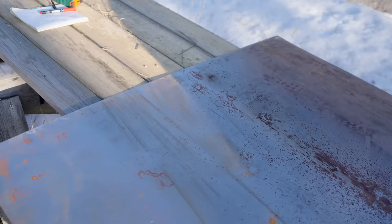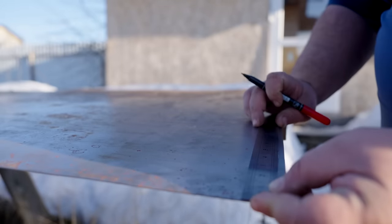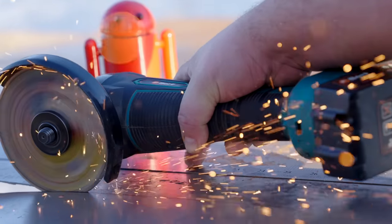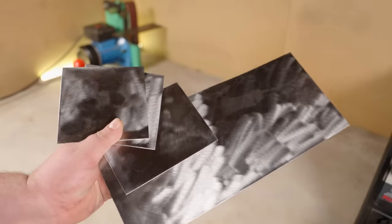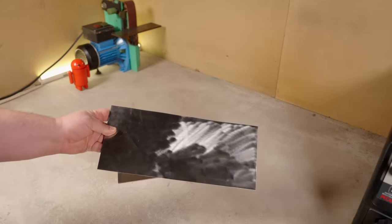We'll be using whatever I can get my hands on, so I'm gonna work with this old 2mm thick sheet metal for a prototype. Also gonna use some empty tin cans for an experiment, sorta like a test run. I'll cut some pre-measured pieces out of the sheet, clean them up to look nice and tidy, all on the workbench. From the sheets, I'll make a couple of tubes of different sizes and two circles that'll serve as the bottom and lid of the contraption.